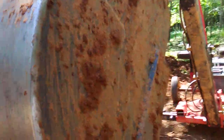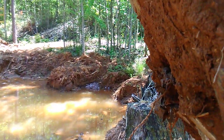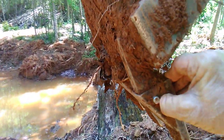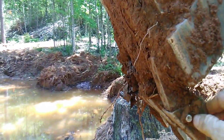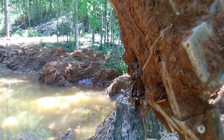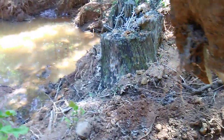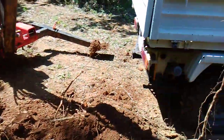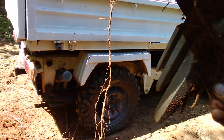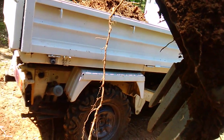And of course these are metric. So I wound up getting a, now I think it's 7/16, if I remember correctly. But something to do, since these teeth are going to be hard to come by: if you are not checking the cotter keys on these pins, check them. Because that's obviously what happened. My cotter key, for the first time after 4 years of using it, broke, and I've got to get some more. This cotter key's too long, as you can see, but it was the only one I had.